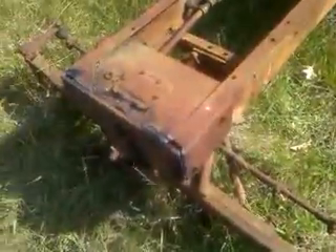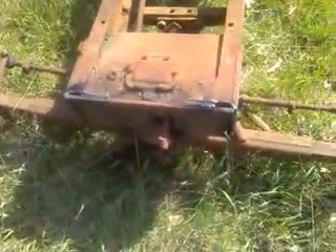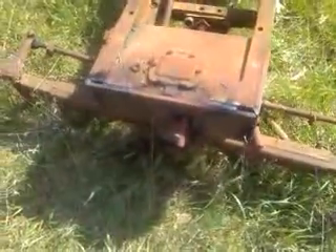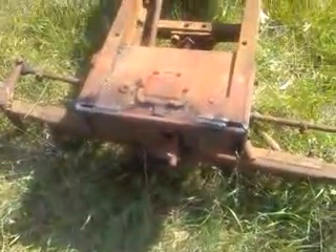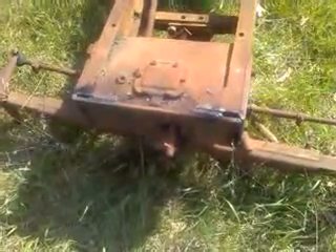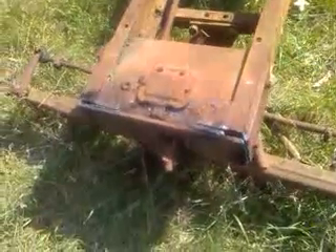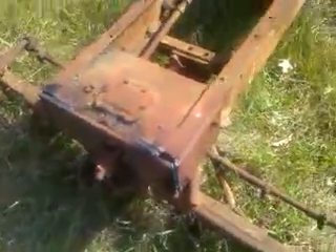I have a narrow front WD and my steering gears are all locked up tight. What happened was the push crank start rod had been removed by the previous owner and the holes weren't plugged in. Mice got in there and made a big nest, dried up all the oil that was in there, and with the mouse piss and whatever, they locked up that front end really tight.